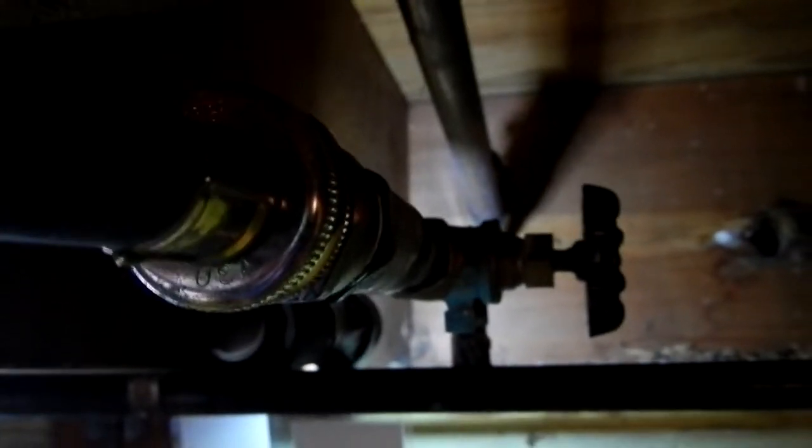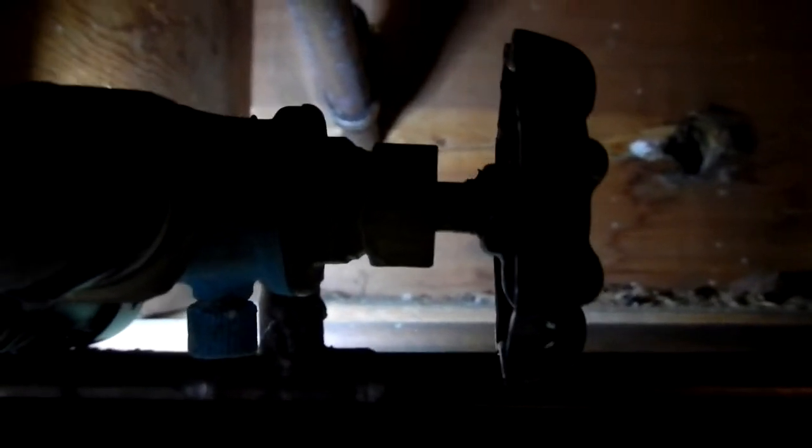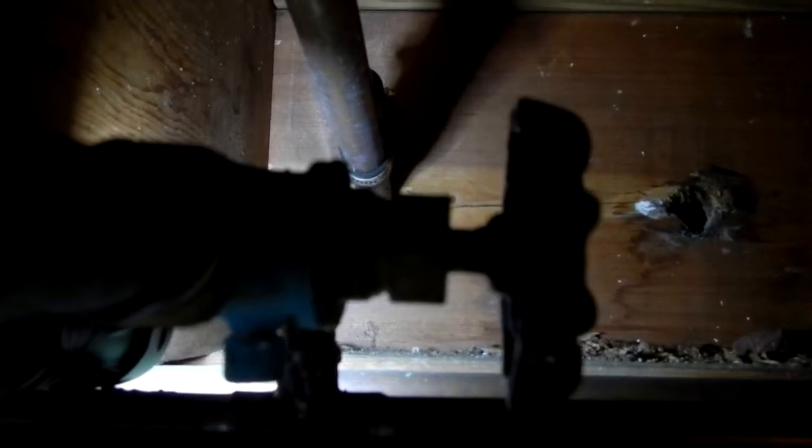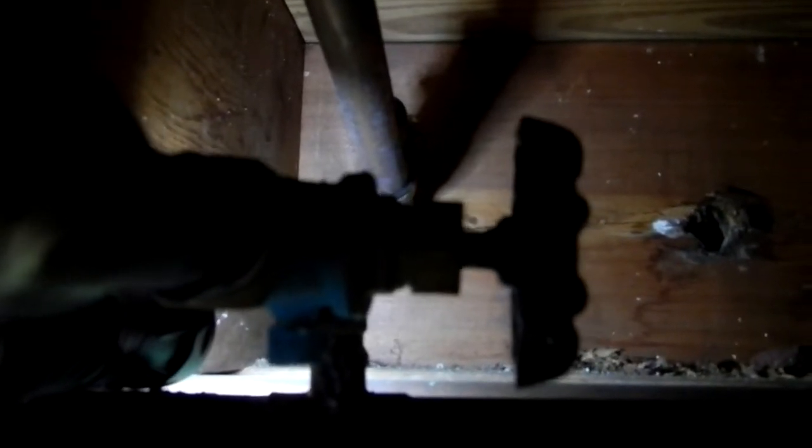There's the rubber six-foot washer hose that goes into the shutoff valve that goes down into my supply lines. That valve is the one that I would shut off or turn on when I want to put water to the outside when I need it in the cold. In the summer I just leave it on all the time — this is strictly what I have to do when I use it on rare occasions when it's very cold out, to keep the line from freezing.